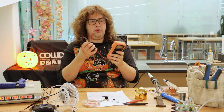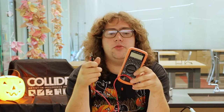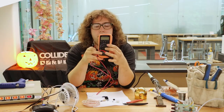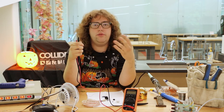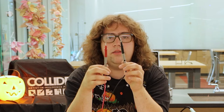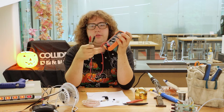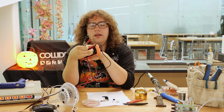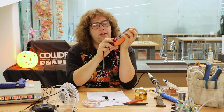Additionally, if you get into electronics, you're going to want to invest in a decent multimeter. It's called a multimeter because it will measure multiple things — it'll meter multiple different ways. A decent multimeter has got a readout that you can actually see in whatever context you're working in. So if you are doing repairs in the dark, you'll need something that has a backlight. It's got leads that aren't going to break. The absolute cheapest multimeter leads will just fall apart on you after just a couple of uses. So if you're going to do a whole lot of this, make sure your leads are nice. But you don't have to get the leads from the same company that makes your meter — they're all standardized around this banana connector, so anybody's leads should fit anybody else's meter.